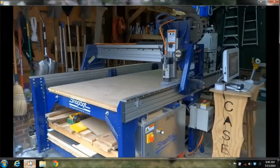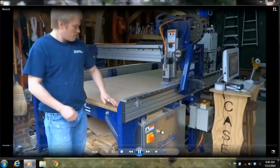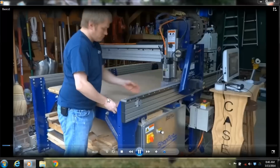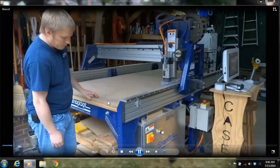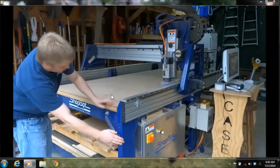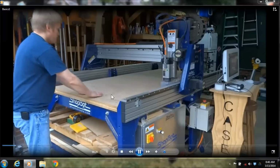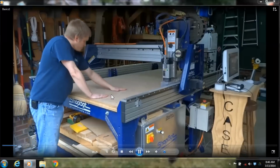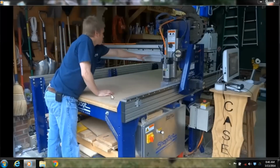So just to go over some basic stuff. The first thing here is you see this is a machine that has a 48-inch by 96-inch cutting surface. It is called the X, the Y orientation on the axes, and then your up and down is your Z axis. All of our machines are made out of steel. They just come in different lengths and widths. You're going to have a spoil board on these. It's a sacrificial board. That's what your part will bolt down to or hold to.